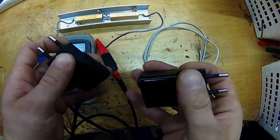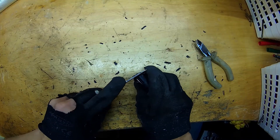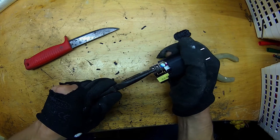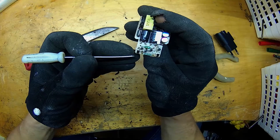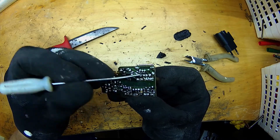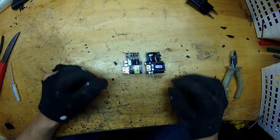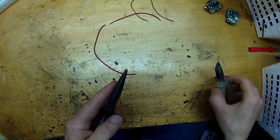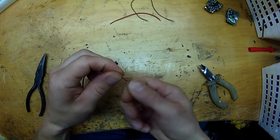I will be replacing them with these mobile chargers — they are actually just 5 volt power supplies; you can find these anywhere. Let's extract the actual modules from their casings. Use safety glasses and maybe some gloves when extracting electronics from sealed enclosures. Here is the actual power supply module — these are the AC tabs, and these tabs are the USB connector where wires will be connected for the 5 volt output. I prepare some thin gauge wires for the 5 volt connection — I have a strange way of stripping the ends, but this is how I've been doing it since I was 12 years old.